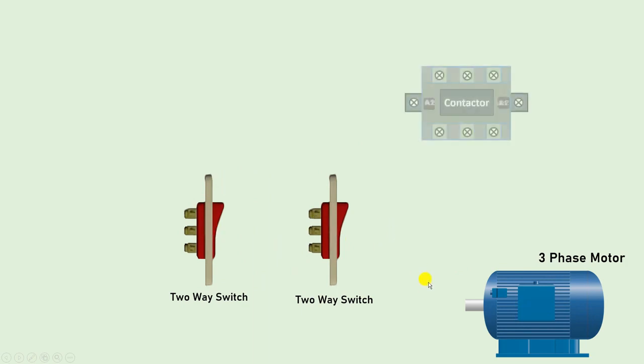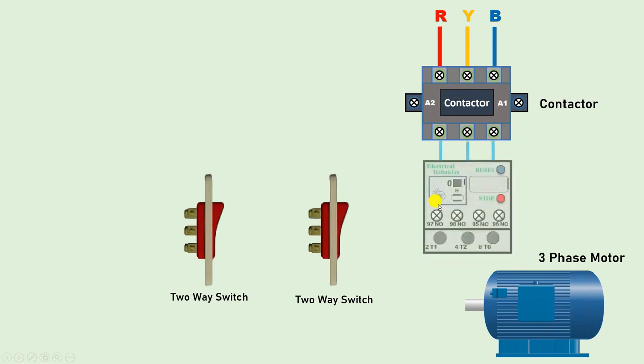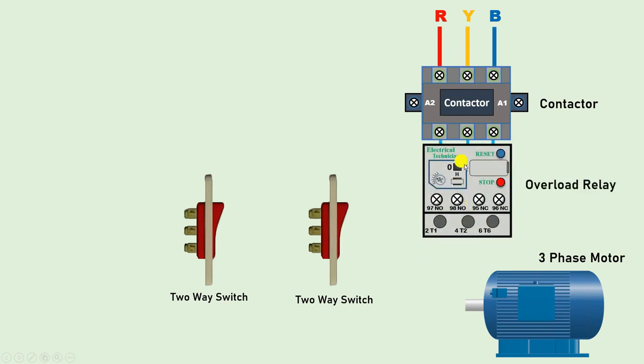For this work, you need a contactor. Now with this contactor, you have to connect the 3-phase power supply. So here I have a 3-phase power supply, and I am connecting this power supply with the motor. Now for protection of this motor, we have to use an overload relay also. Connect this overload relay with the below terminals of the contactor. Now from the output terminals of the overload relay, take the power supply and provide it to the motor. You can see the power wiring is done here. Now if this contactor gets turned on, the motor will turn on. When the contactor turns off, the motor will also turn off.